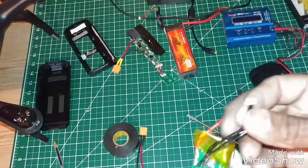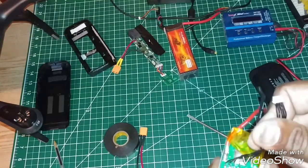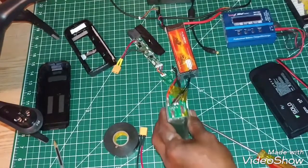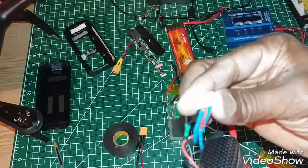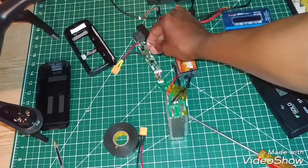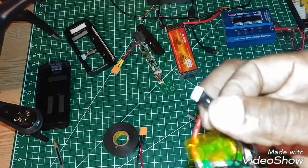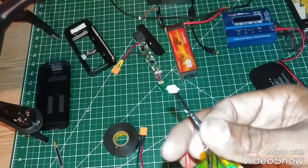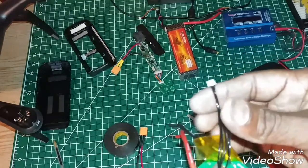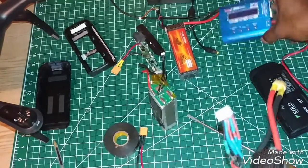To be able to use a regular LiPo, this is the balance port — the actual terminal for the balance cable. This is usually smaller than your normal one. Your normal LiPo batteries usually have a larger one. I purchased a few of these small micro JST connectors — you use them basically for the Pixhawk, for things like telemetry radios. I ordered some larger ones so I can convert it and actually have one in so I can use it with my regular balancing charger.